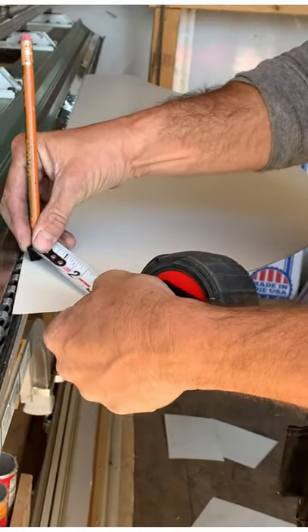Now we're going to take a little touch-up and hit this little nail here because it's bugging me. Then we're going to caulk around this keystone. You've done pretty work now, so don't mess it up — just don't need a whole lot. Just pretty up the edges, clean it up. And now we're going to glaze around the glass and make sure this thing doesn't leak.